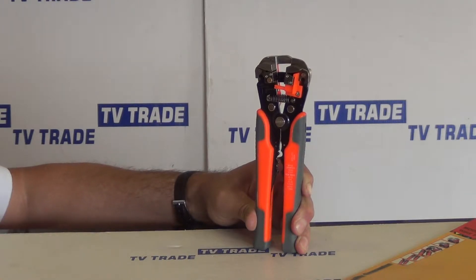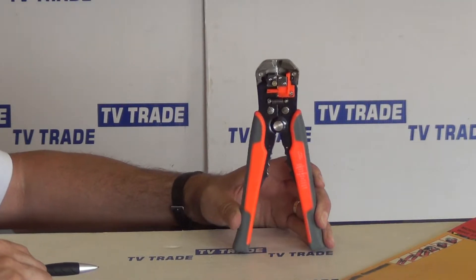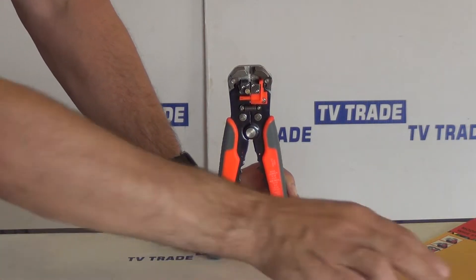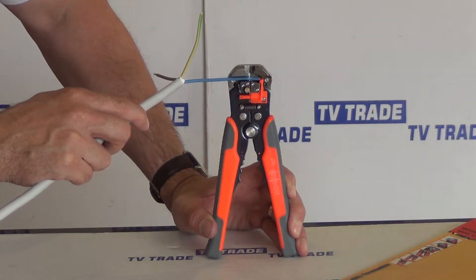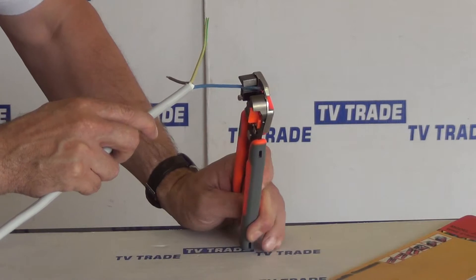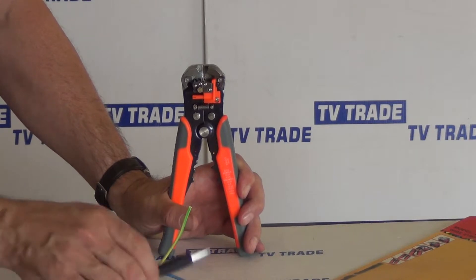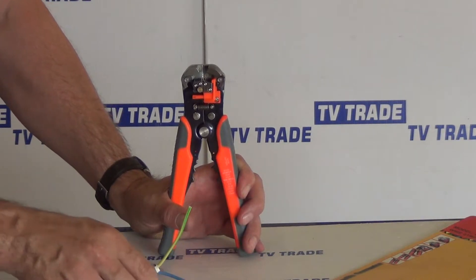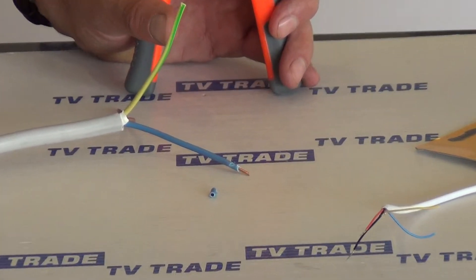So if you have a cable that you don't want to insert directly into a terminal point, you just put a connector on the end — that'll give a good connection on the far end. You can use the crimping tool to do that. Now let me demonstrate. I'm going to slide this electrical cable through here, go as far as the orange guide on the far side, and then compress it. And you can see what we've done — we've stripped back this small piece of cable. That's the first thing, using the stripping mechanism.